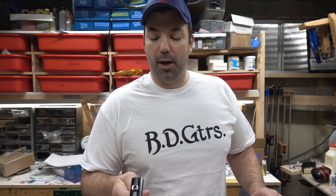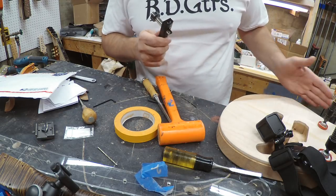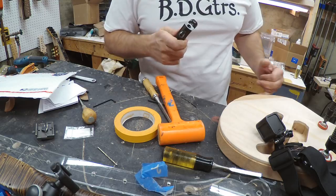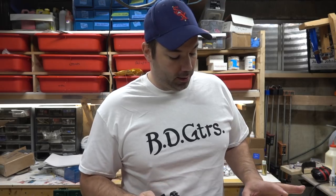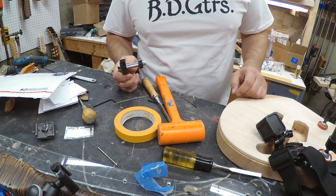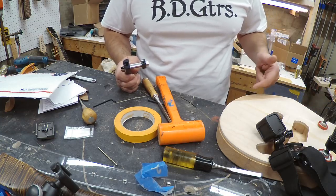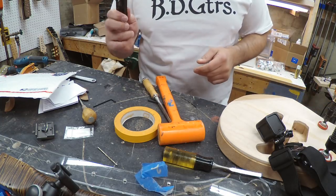It's a longer process. The curve side is for the tighter curves, and the flat side is for the longer runs. I'm only doing the arm cutout, and what I'm doing is actually pretty difficult because I'm going into the end grain of the African Mahogany, so that takes a little bit longer. If I was just doing the sides it wouldn't be so bad, but going into the end grain and cutting it on an angle is a little bit more difficult.